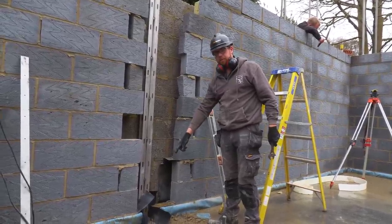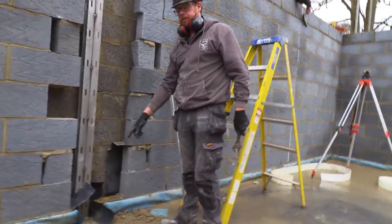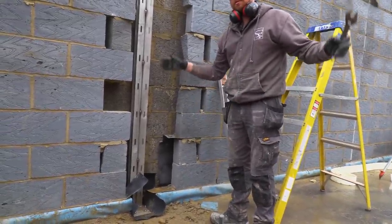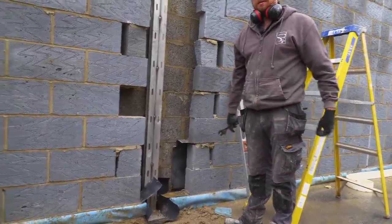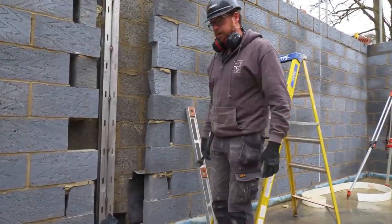Unfortunately the damp membrane's broken now. But because we're having a flow screed, we've got another membrane going over the top — so a whole other one's going in there as well. We're all right, otherwise we'd have had a bit of concern there. We're having to maybe blackjack the floor before we screed it, but we'll be all right.